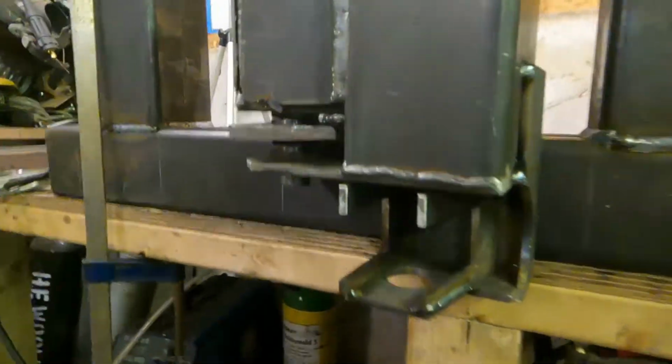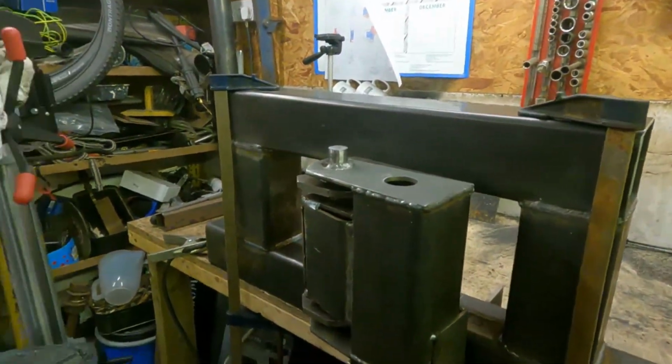Third, fourth, fifth problem, whatever we're on now. Our cylinders in the UK are all inch pins, 25.4 millimeters, whatever. So everything that is called for 3/4 pins is null and void. We don't need it. So we need a lot more bushing stock for inch pin. No problem. We'll just order that up and get that. I only need another 1200 mil or something like that, so not much, 4 foot or something like that.